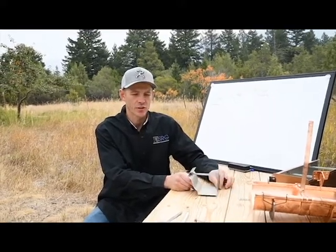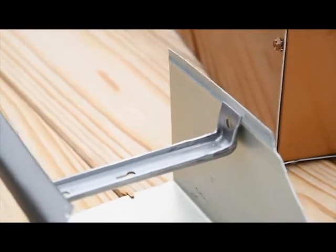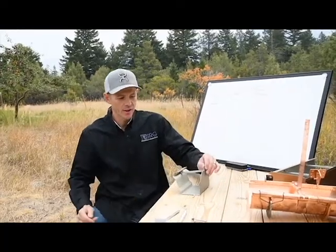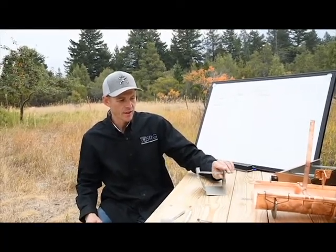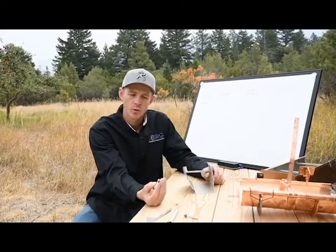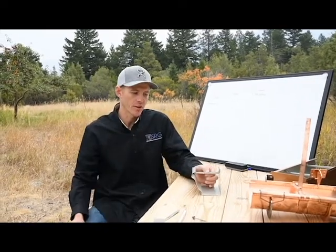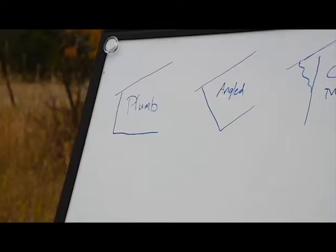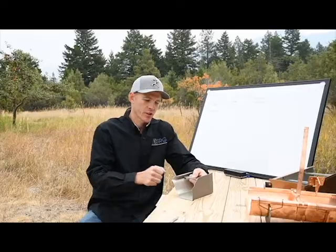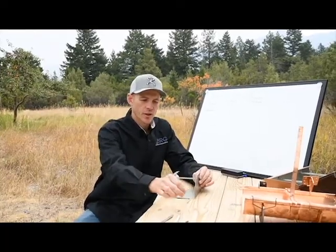We'll start with the simplest, easiest process and easiest fascia design. We use a Raytech hidden hanger — this is the hang tight bracket. This particular one is a five-inch K-style gutter. These rock into the front of the gutter, and you line that up with the bead on the back. Our normal contractor package includes a standard inch-and-a-half zinc-plated screw with a quarter-inch head. Keep that hanger fairly level when you install. We use an impact gun with a six-inch driver so you don't have to get over the front lip with the drill.